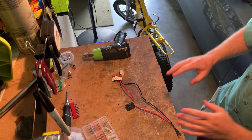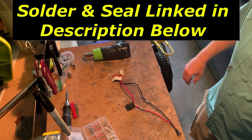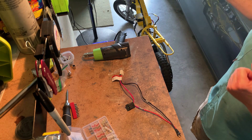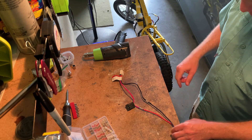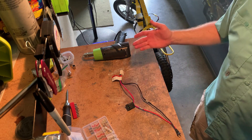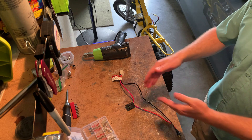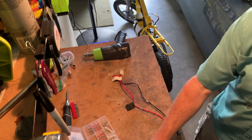The solder-and-seal is really nice — it just melts and seals the wire. I'll let it cool for five to ten minutes, then connect it, put everything back together, and it's ready to roll. Connect red to red, black to black — that's really it. I added a fuse as a secondary safety feature; most lithium-ion batteries already have a BMS which controls amperage, but the fuse is there to protect the control module.